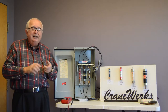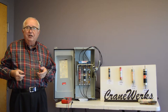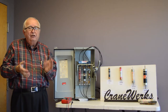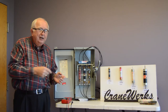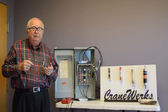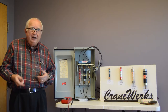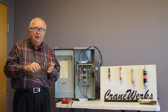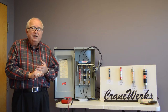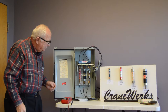But if you have a dead short, somebody puts your collector rails together, you can pull thousands of amps. These will blow in as little as 1/100 of a second. So you've got those two ends of the spectrum. One line going to ground can give you a fault, and it will go out in 1/100 of a second if it's a good solid fault connection.